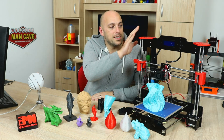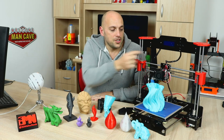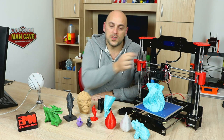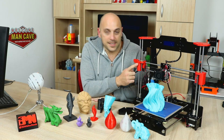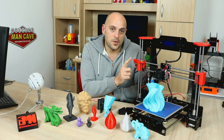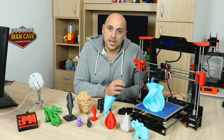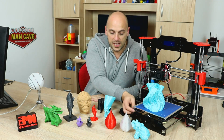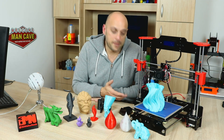In the meantime I did a few upgrades. You've seen the upgrades I did on the z-axis mounts up here with the bearings, just to remove any slack there was on the z-axis rods. I also replaced the x-axis mounts for the stepper and the idler on the other side. I also installed thumb wheels just to make it easier for me to level the bed.